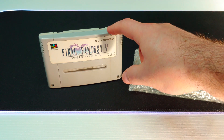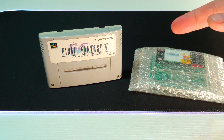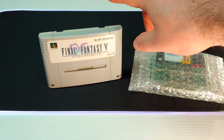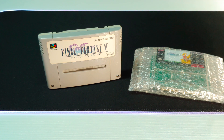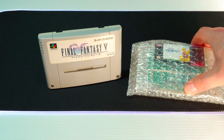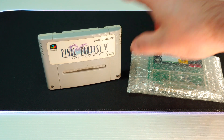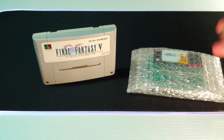You can replace the ROMs inside. There are also boards that attach to the underside of the cart, overriding the onboard ROM with their own ROM while leaving the original ROMs intact. I went with a third-party clone maker because I wanted to keep the original cart completely intact — it's yellowed and I may need to re-retrobrite it — and I wanted to see how this particular company did with their clones.